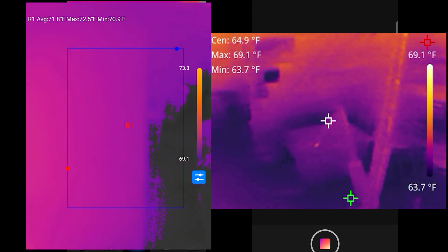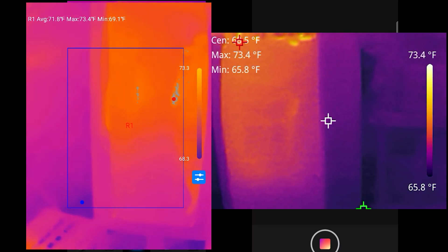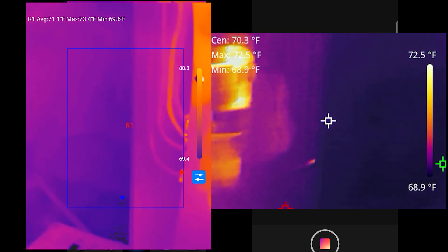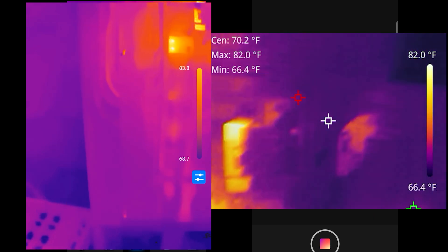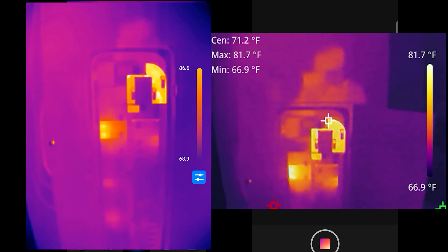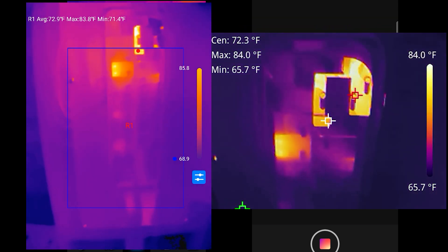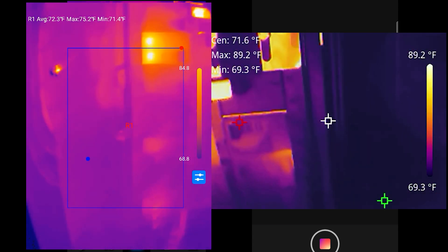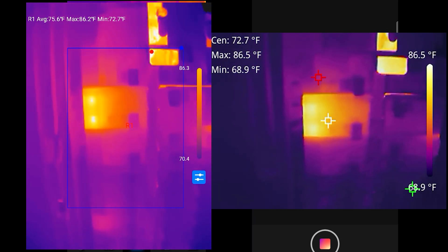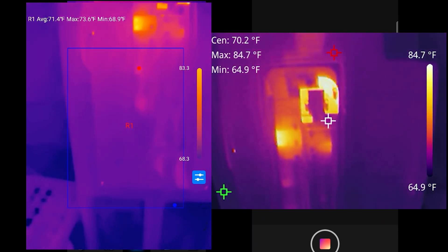Let's continue down to an electrical panel. I'm going to show the reflectivity of the heat off the steel to my body. Let's open this up and put them both together. You can't see any of that with the naked eye, but it looks like I've got some heat going in here. Let's take a look at that top area — that's my second breaker. I've got some heat; I'm pumping some heat. That's probably my dryer — I guarantee it — but it's not really too hot, and I'm pretty happy with that.